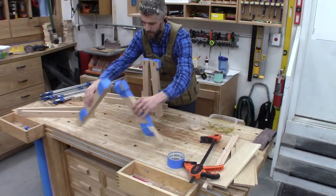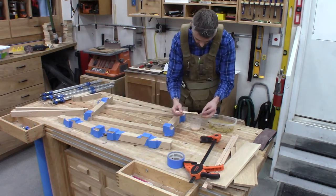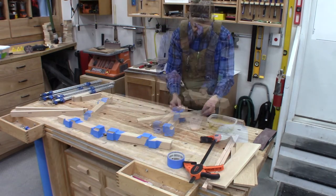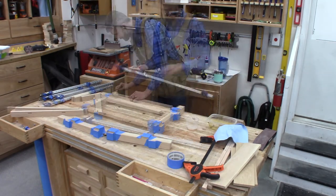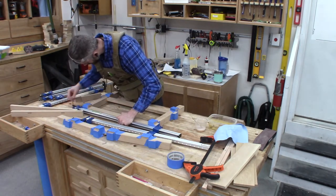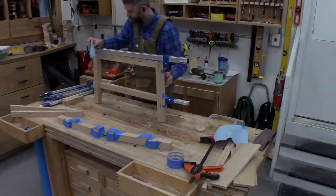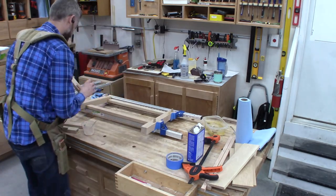After the bench seat was all prepped and sanded, I turned my attention to the legs and stretchers and got them all sanded up. Now I'm moving on to the glue-up. I'm using epoxy here — I've only used it maybe one other time in the past when I was making a big barn door. I also cut off a lot of three and a half degree chunks of scrap that I could tape onto the legs to keep the clamp faces parallel to one another. Doing this before you get the glue on the piece saves you a lot of stress.